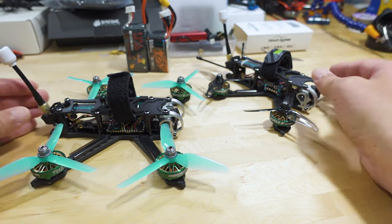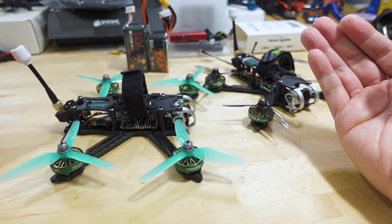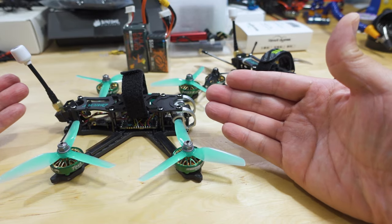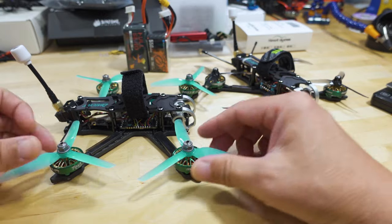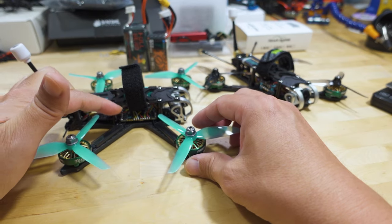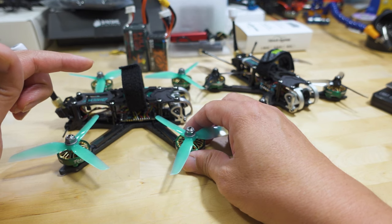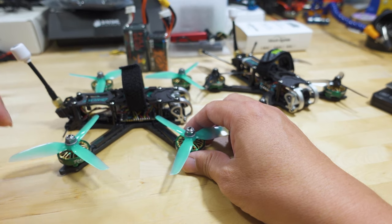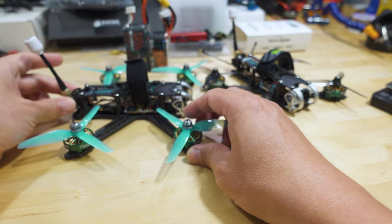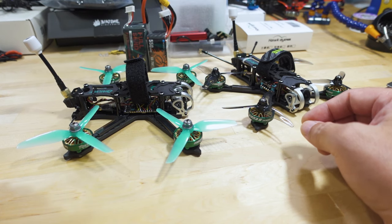So that's the bottom line on these two. I think the F4 needs a little more work — I would recommend a different motor KV, and if they're going with the all-in-one board they probably can't do that, so they should be going with a dual-stack separate ESC board and a higher KV motor. That's my recommendation. If you have any questions, let me know and I'll talk to you in the next video.